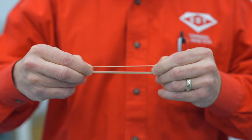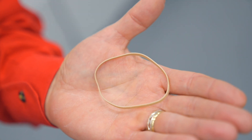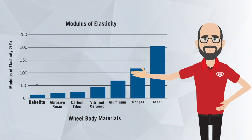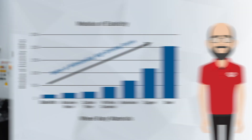Finally, we look at the modulus of elasticity, or MOE. This measures how much a material deflects under force without permanently deforming. Think of a rubber band being stretched — as long as you don't apply too much force, the rubber band will retain its original shape. For applications that need to withstand high grinding forces without deforming, we turn to materials with high MOE.